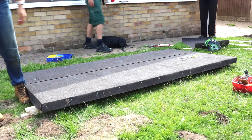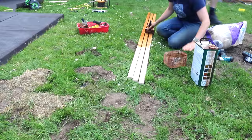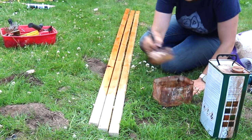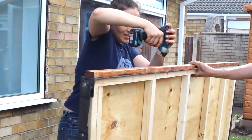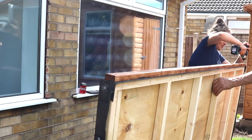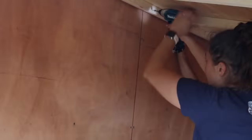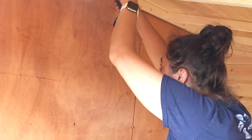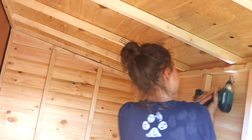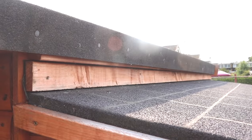Once complete, I moved on to staining the three roof trim pieces and left them to dry before screwing on. Quick tip: if you're in a rush, just throw some sawdust on it after and it'll dry instantly. Make sure you don't add a trim to the side that's obviously going to be attached to the building. After screwing and putting the last roof trims on and placing it on top of the shed, I screwed it to my workshop shed where we could tell where the spars were, and screwed underneath the tops of the frames. We'd also fitted another piece of felt and trim between the two sheds to create another overlap, so rain wouldn't go back that way.